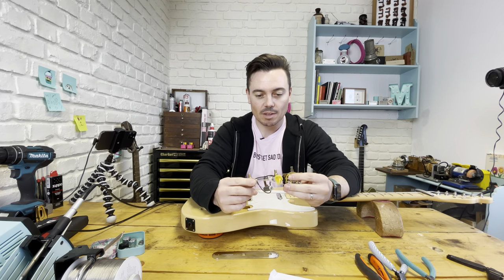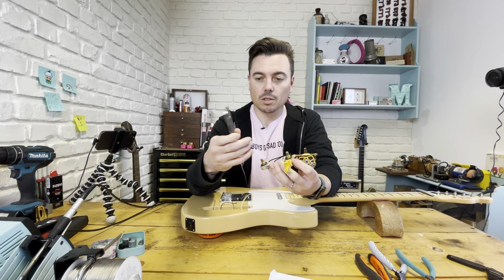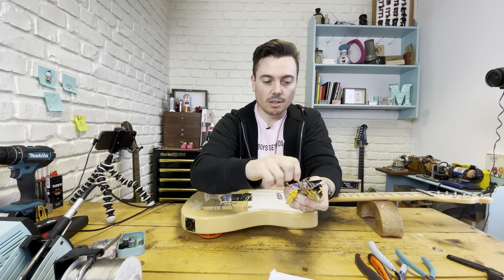You'll see that the loom comes with everything you need. One of these is a star washer or a locking washer and that gets squished between the pot and the plate and stops things vibrating loose - very important. So we go locking washer on the two pots, then the plate, then one of these which is called a dress washer on top, and then a nut. Just finger tighten those up for now.